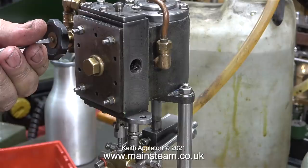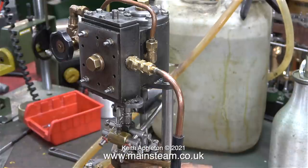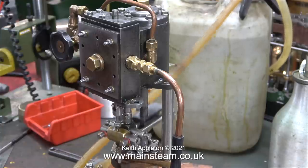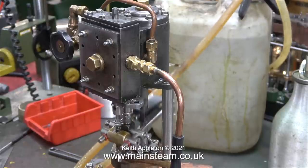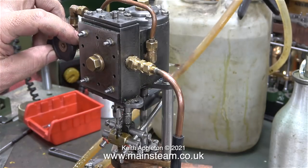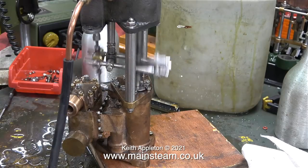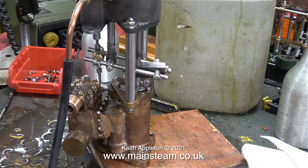Time to stop the pump and finish the reassembly. This valve on the exhaust is a bit of a puzzle — by closing it slightly and putting some exhaust back pressure into the system, the pump runs a lot more smoothly. This is pumping water quite well now; you can see it by the way the silicone rubber tubing is dancing about. You can hear how the sound of the pump changes as I close the valve slightly. I disconnected the water and now the pump sounds like this. At this stage I removed both of the o-rings that I put on the shafts, and thankfully the valve block is now staying inboard of the shafts and not trying to fall off them.